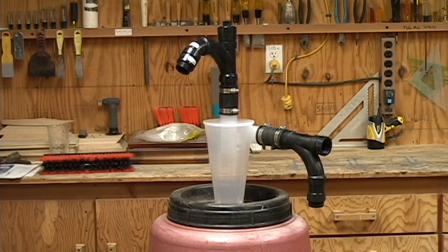I'm hoping I can get my heavier sands — I think it's only going to be minus 60 running through there — but if we can get it to spin down that cone and drop into that tank, that's going to go a long ways toward allowing me to maybe put another filtration system after this and hopefully deal with the plug-ups. I'm kind of excited about seeing this thing work. I know it works well in a shop when you're running a table saw — you can see all the material just spiral right down that cone with very little getting back into your collection system.